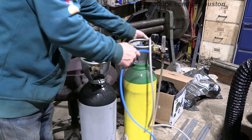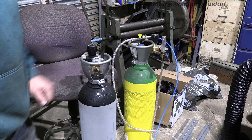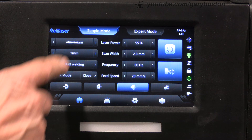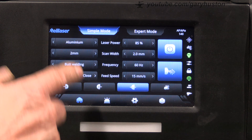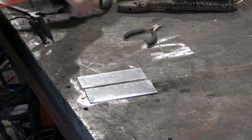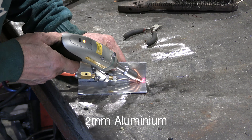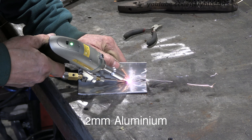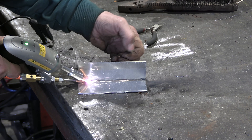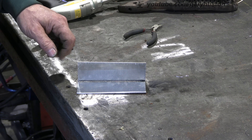I'm going to change the nitrogen for argon because we're going to have a go at some aluminium now. You can use nitrogen for cutting and welding stainless and carbon, but you need argon for aluminium. We'll change to aluminium and go to two mil because that's what we've got. I've changed the wire - I think it's ER5356 or something like that, the harder one of the two - so it pushes up the liner easily. If you use a softer wire it can bird's nest and doesn't push up the feeder very well, but this one does.